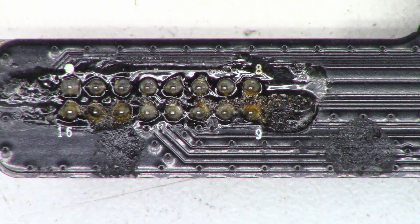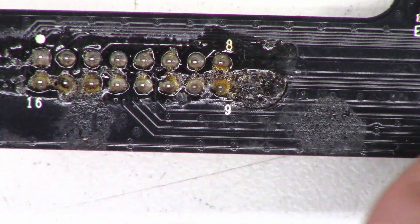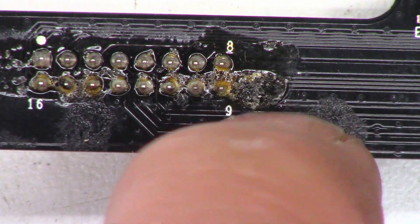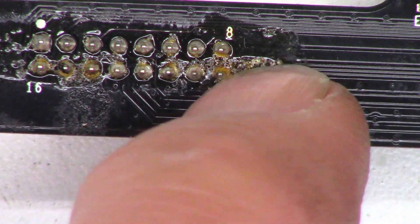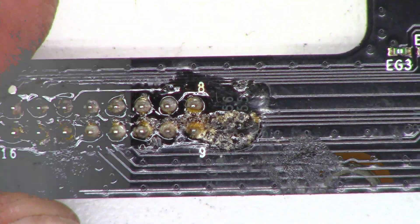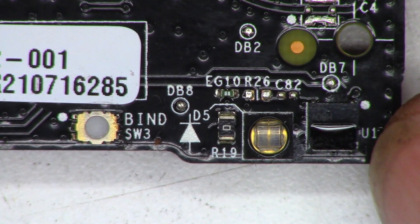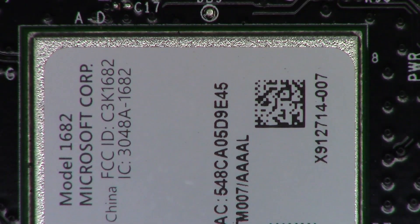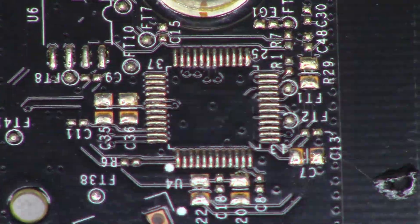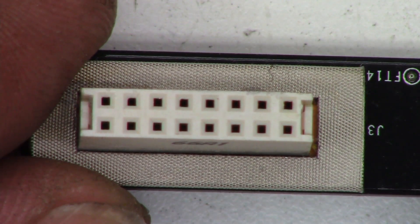Well, I may have just inadvertently stumbled over the most important clue right here. Look at this connector — it's got crud spilled all over it. All that is sticky gooey mess. This is the connector that connects — you can see the eject switch right here, might possibly be the power button, there's a remote control receiver right here, and there's a little Bluetooth module right there. I think I'm going to go ahead and clean this board off and then we'll try to power it up.